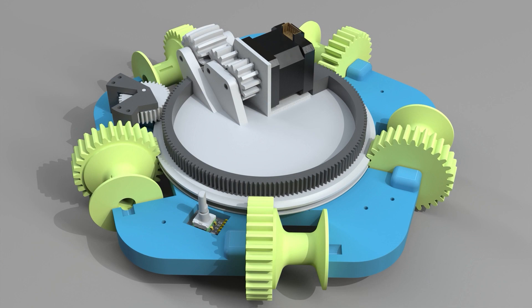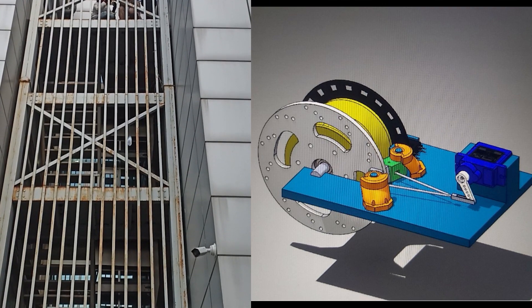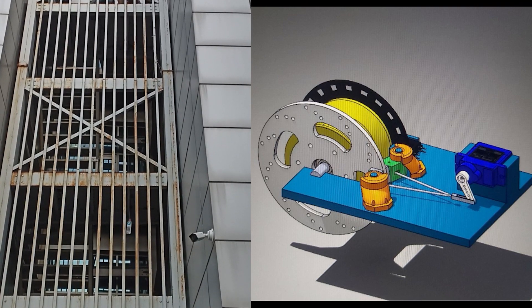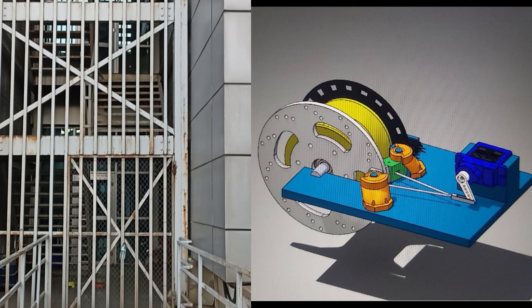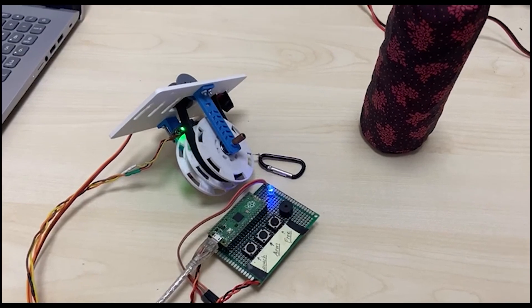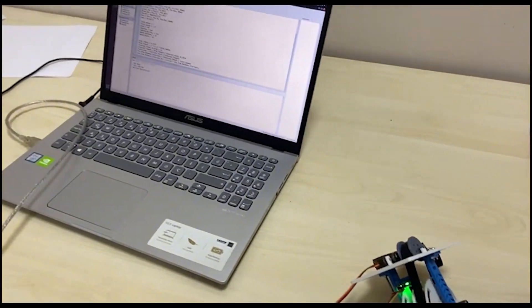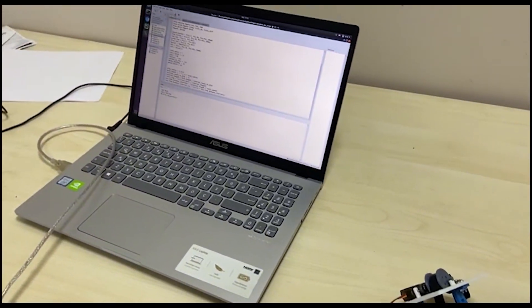Four models were considered for the airdrop mechanism. The first was a rotational underactuated mechanism using two stepper motors, but it was too large, too heavy, and prone to unexpected failure. Two other alternatives used free-fall via braking: one used a disc brake, which, although light and fast, created large oscillations in dropped payloads and rapidly changing external forces on the drone, posing a safety problem. Another used a band brake, where folding speed was controlled by tightening and loosening the band. Finally, the current DC motor model was selected for its reliability, controllability, compactness, and lightness.